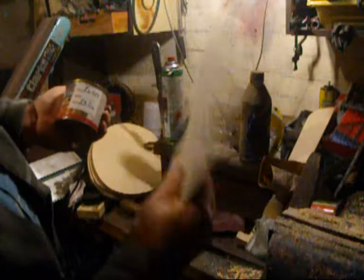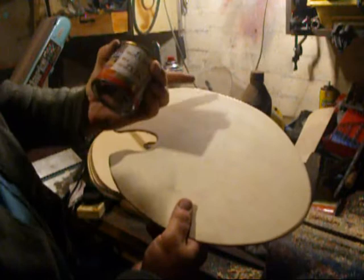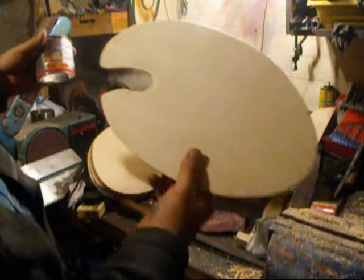So eventually you'll have it nice and sanded and a coat of varnish. Just before you put the varnish on, you want to get all the dust off and then put some white spirit on to get all your fingerprints out. And then hopefully it'll be a really good seal to put the paint on.